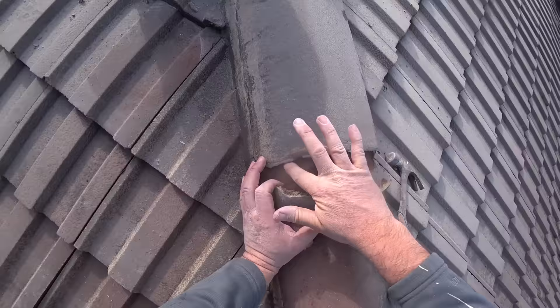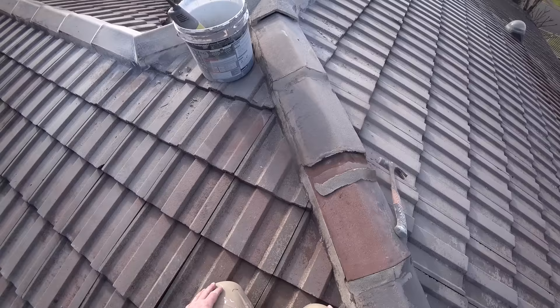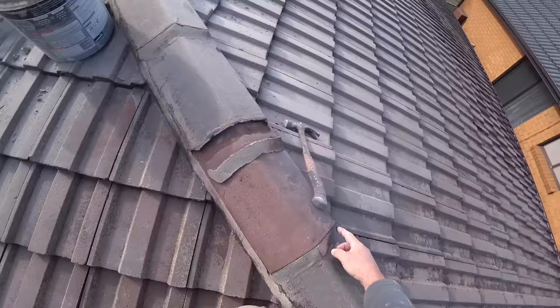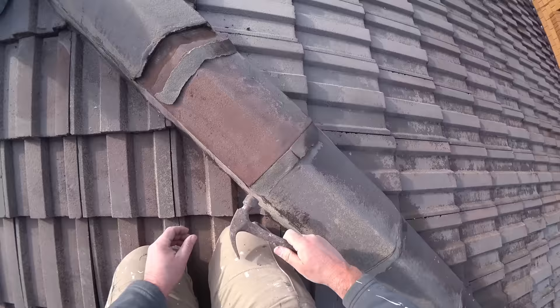There are signs of water getting in, in a roof and under the roof. So if you're going to do this, you need to use a flexible pointing — one that sticks really well. It doesn't crack at the points where the tile and the pointing joint, and this is very critical. You can see it's the same problem on the bottom one.